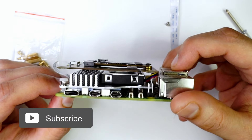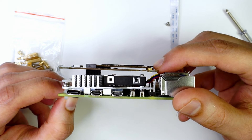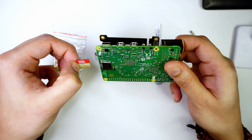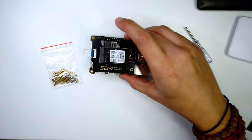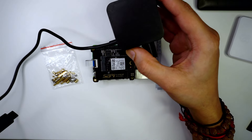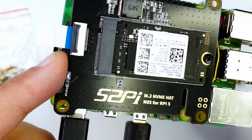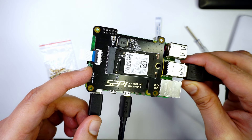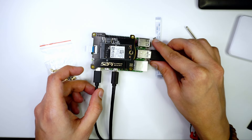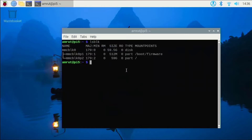There is quite some gap between the fan and the board, and a little bit of gap between the SSD and the board. I'm going to remove the micro SD card and put Raspberry Pi OS on it. The SD card is in, and I'm connecting the official Raspberry Pi charger. The Raspberry Pi has started — the LED on the board is dimly lit, meaning it has power but the NVMe drive isn't active yet. Running the lsblk command, we can see only the micro SD card is currently available.